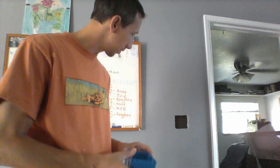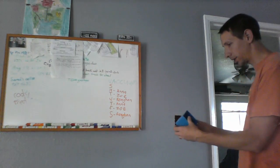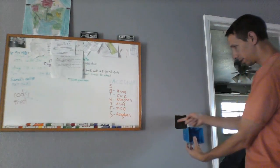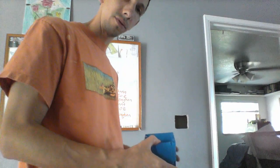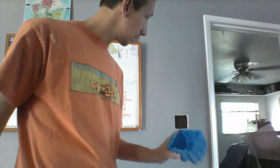We're back — perhaps I got the wrong box. You can buy one for existing construction when you already have everything in place. I was planning on just slipping this part underneath the sheetrock but I don't think that's gonna work. So what I'm gonna do is just cut this tab off, then it'll fit snug in there, and I'm gonna put a couple of screws into the stud inside the box — just drill right through it and anchor it, one high one low. If you have the same kind of problem, make sure you cut your hole right next to a stud. We're gonna go ahead and cut this tab off and do that.